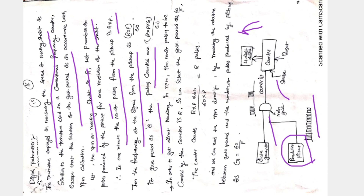The pulses counted by the counter equals R × P × G / 60, where G is the gate period. To get a direct reading in RPM, the gate period is set to G = 60 / P. This way the counter directly reads out the RPM. By making the gate period equal to 60/P, the relationship between gate period and number of pulses gives the direct RPM reading. In summary, pulses are generated and counted, then the speed is displayed on the digital tachometer. There is no direct contact — only a toothed wheel, light sensors, or sometimes a laser technique is used. The laser light falls on the rotating object, pulses are generated according to speed, and the counter displays the result.